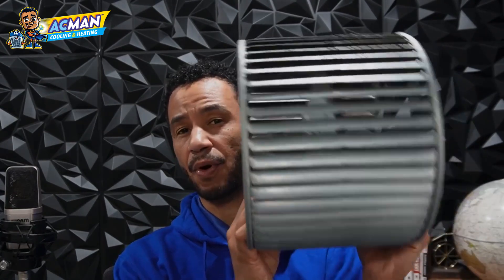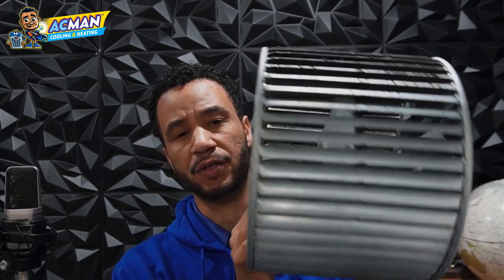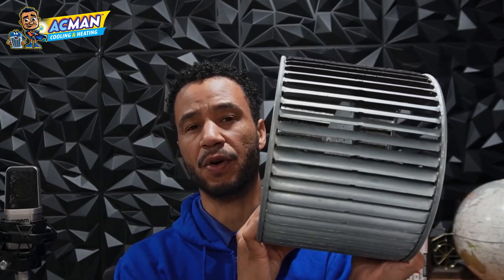It'll cause a lot more resistance on the fan, which will cause you to have more fan replacements — the fan will burn out more often. So this thing needs to be cleaned. This is one of the reasons why an HVAC tune-up is important, because that dirt has to come off of this squirrel cage. It's blowing all that dirt and nastiness in your house and causing resistance, causing your fan to go out more often.